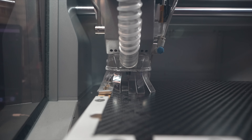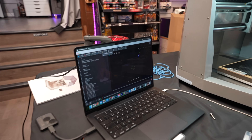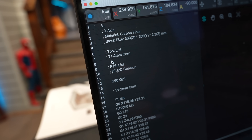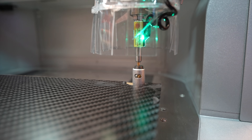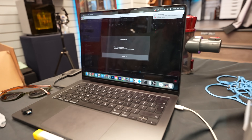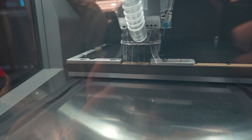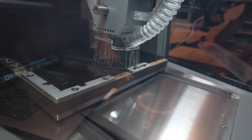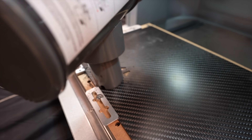Where's the empty ring bruv? Did we just change the tool anyway? I think we just changed the tool anyway. But look, it does say T1 — 2mm — so it will tell us to change the tool. And also we're going to have to probe it again anyway. Oh my god I'm so scared, it says change to the probe tool. The process didn't take long for us to figure out and become actual professionals at doing this thing. Now it asks to change the other tool so we're going to change the other tool. The reason we needed to change the tools each time was because the size of the holes and the size of the outside cut were slightly different. So we used two tools. Oh my god, it's really working — we're making drones!